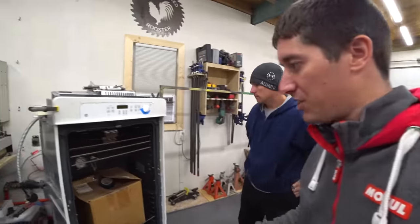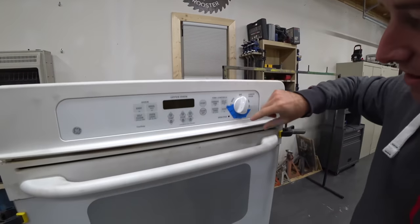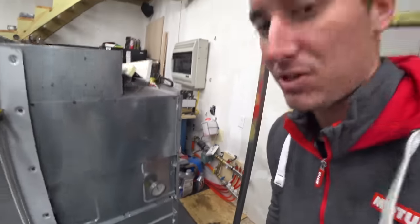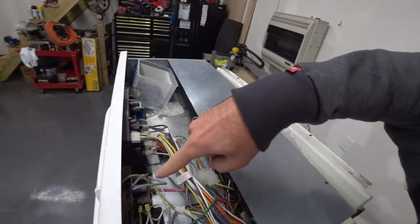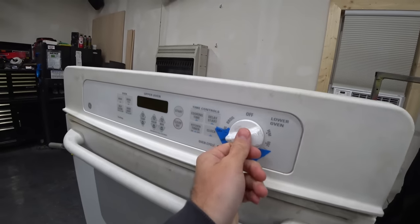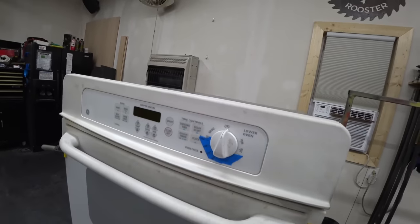So this is the finished powder coating oven. We're talking about putting a real temperature control in there because this is a little bit nonsense, and obviously the oven controls are just the analog one. We've got marks there which show the actual temp in the oven according to this laboratory thermometer that's shoved in there — that was $10 at the yard store, and it's calibrated too. The analog control is the only thing running, and anything in here is just the lower element. When it goes to broil, you hear the click — that turns on the upper element. There are a couple clicks from the microswitches to tell you what's going on.